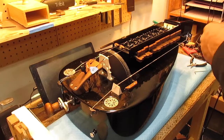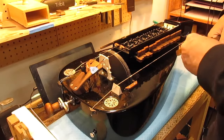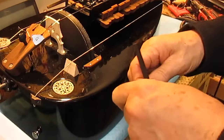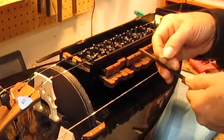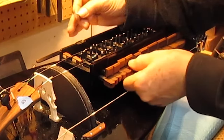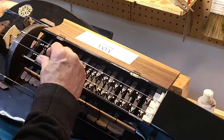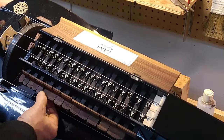I'm pleased with the outcome. We're going to do the same thing on the other side — the screw should work smoothly but hold tight, and that's our goal. Get some wax on this retainer screw — the one that doesn't allow the key to pop out. Let's put things back together. Slide right in. Put the retainer screw in first, take it down to the level of the other ones. It's got a little wax around the outside but we'll clean that up in just a second — it's doing what it's supposed to do, just like the others.